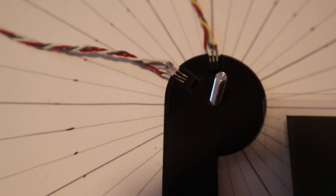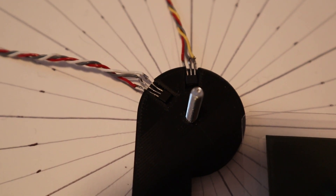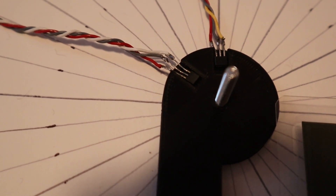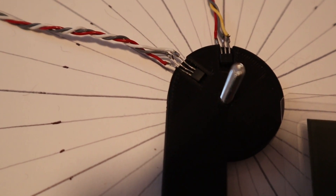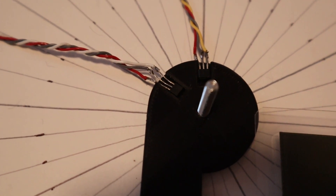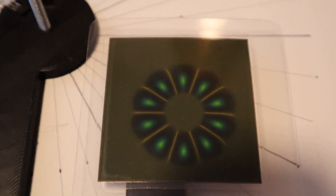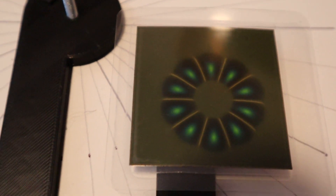On the sensor arm there are two Hall effect sensors, with two slots into which the sensors fit. The slot positions are such that when one sensor is over a bluey-green spot, the other is over a yellow one. The end result is you get sine and cosine waveforms produced, and that enables us to calculate the angular position.